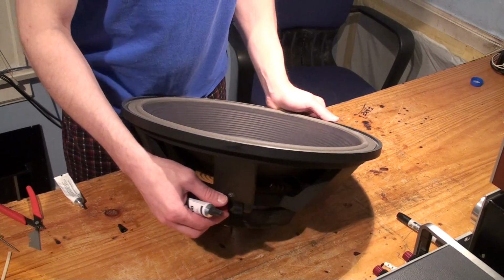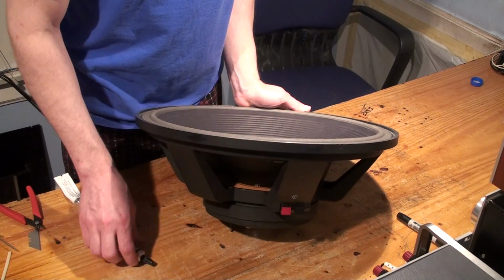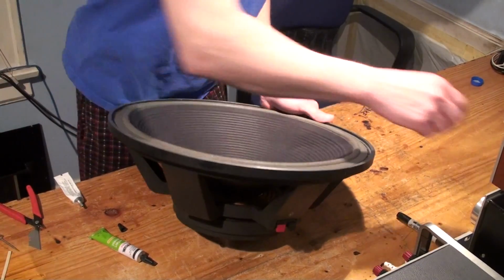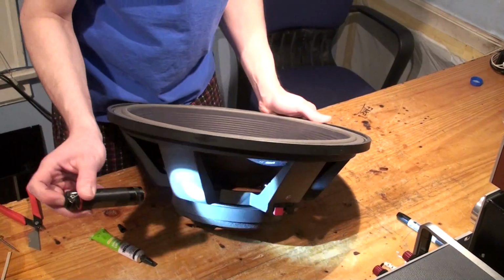On the inside, I don't know if you can see, there are two little metal tangs that we unsoldered earlier. I'll give you some light so you can see where they're going to come out. Right in here, those two holes, that's where the tinsel leads are going to come out, and they're going to lead over to that little metal tang you see sticking out right there. Then we're going to solder that on there, and that'll complete the electrical connection.